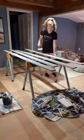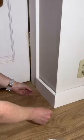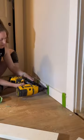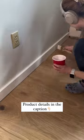I painted the baseboards first, then made my measurements and cut them to size — I used miter joints in this room. To fasten them to the walls, you use a stud finder and shoot nails right where those studs are. Then fill the nail holes, caulk your creases, and do your paint touch-up.